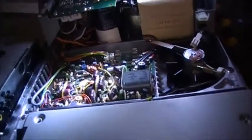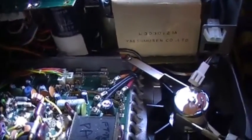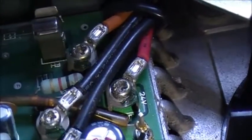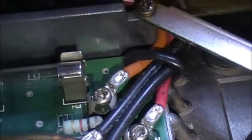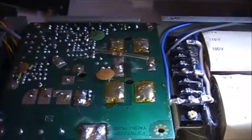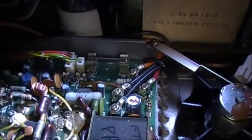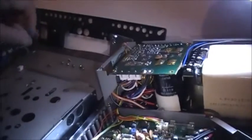The first thing I've got to check is whether I'm getting any power on this PA at all. I must check the 13 volt as well as the 24 volt and see if they're good — whether it's an issue with the power supply versus an actual issue with the PA. We'll check some voltages now.